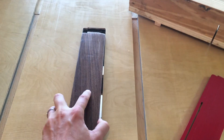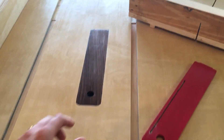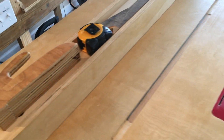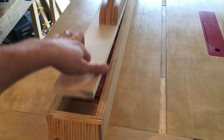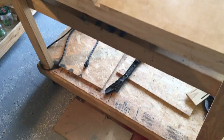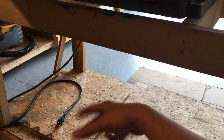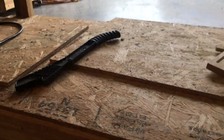Zero clearance inserts are definitely a good thing, especially if you're going to be changing out blades for dado stacks and whatnot. There's some stuff in there just for storage of pencils and sandpaper. I intend to put some sort of dust collection under here, whether that's just a slide-in trash can or something — it's all hollow so all the dust just comes flying down here.